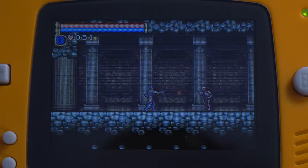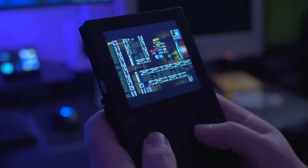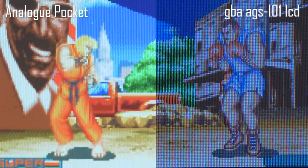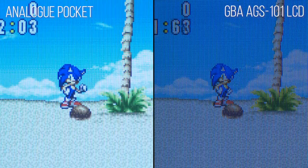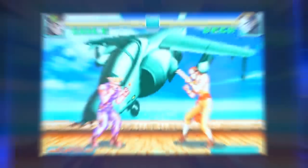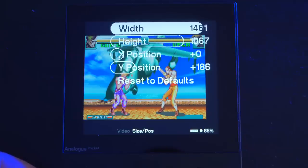Game Boy Advance is the last one and it's tricky. For comparison I'm using an original Game Boy Advance with a later AGS-101 backlit screen installed. The Pocket looks fantastic at a glance, and even with letterboxing due to the wider aspect ratio of the GBA hardware, the actual screen real estate is slightly larger than an actual Game Boy Advance. The issue is that GBA uses a resolution that does not scale evenly to 1600x1440, resulting in some repeating patterns visible across solid colors when using this mode. It's a minor thing overall and not especially noticeable for most games, but you will see it if you look closely. This is where the analog mode comes into play — displaying the game in a raw upscaled pixel mode with numerous scaling options.